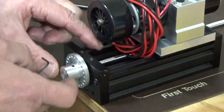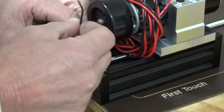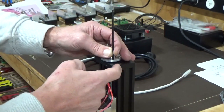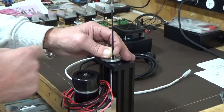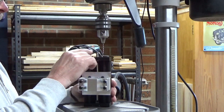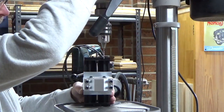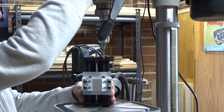That now fits onto this screw thread here and we can lock it down on both sides. What we're going to do now is use the transfer punch to put a hole into this section of the adjustment. That way we can use a key and just drop that in there to hold that position. We're putting our reference hole into the top part of the motor adjustment assembly using a 2mm drill. We need to set the stop so it's not drilling all the way through — it's going about two-thirds to three-quarters of the way.